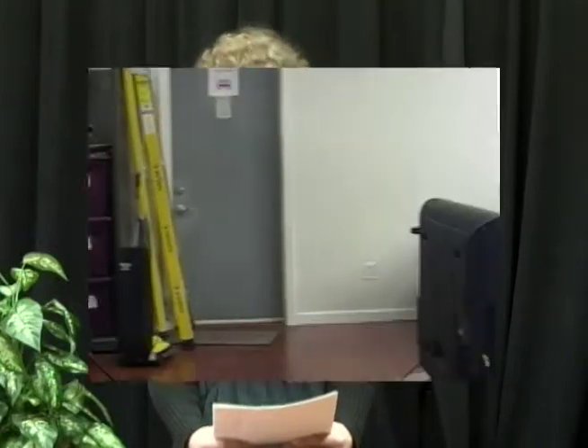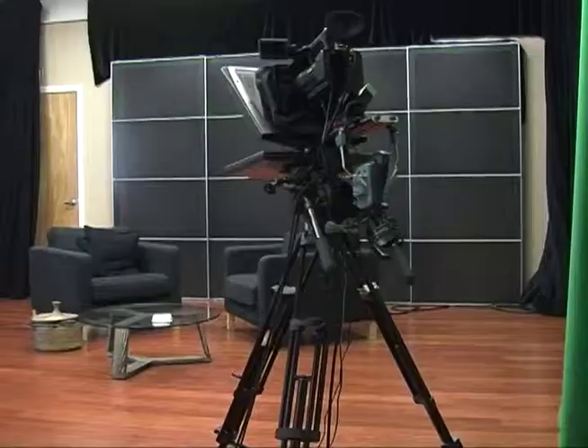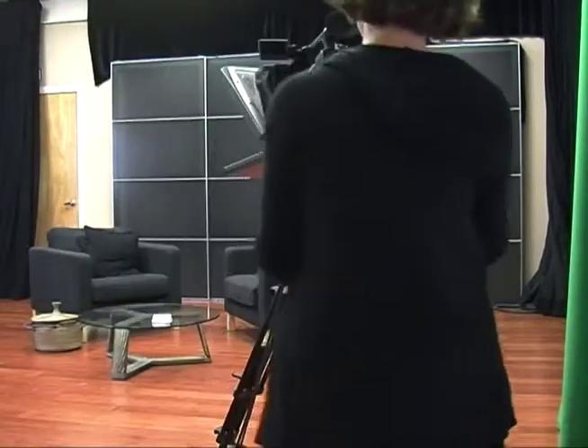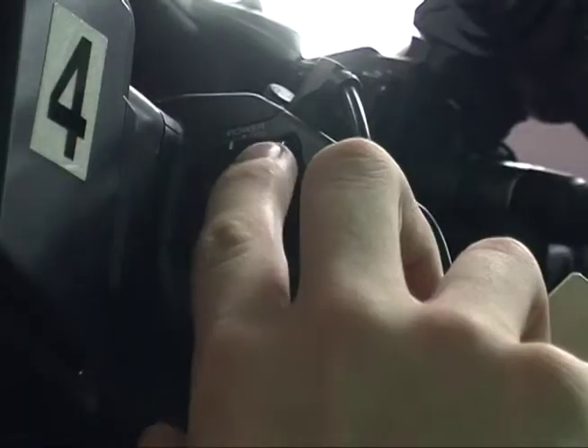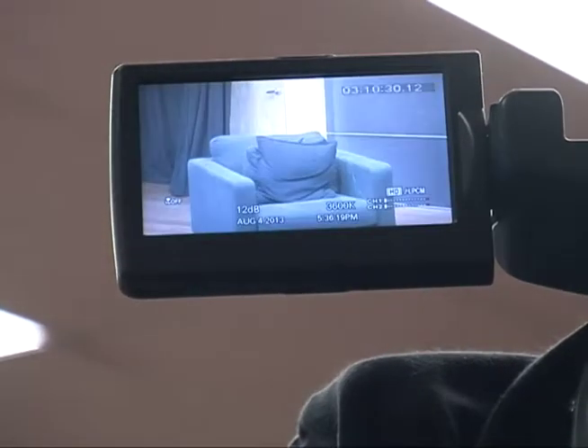Now that you have your control room equipment all set up, we can turn to cameras. The cameras are located in the studio, but they're behind the set. Luckily, turning them on is relatively simple. There's a small switch on the right side of each camera, which you need to flip to the left. Wait a few seconds after flipping the switch on each one, and all your cameras will be on.